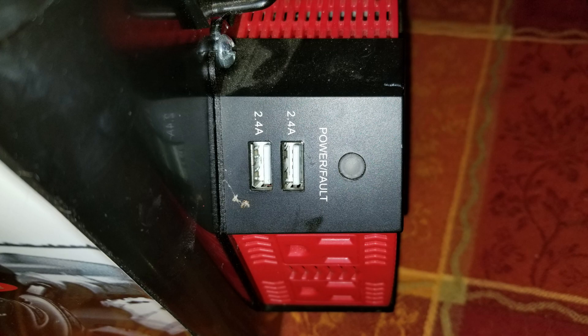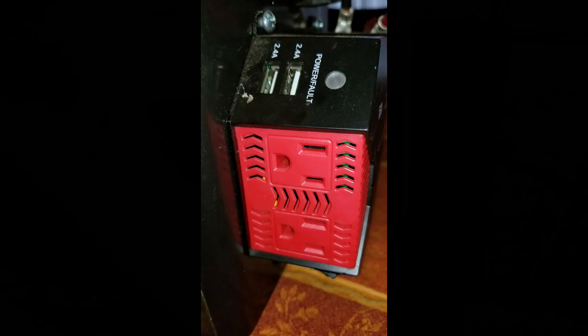It's not pure sine wave — it is a modified sine wave, which is okay for most of what I do. Looking recently, there are some smaller pure sine wave inverters available today that weren't really available in a compact form factor when I put this together originally. They were out there, just bigger and they cost more money. A pure sine wave that would fit this application would probably be at least two or three times the cost. I may upgrade to one before too long, maybe later this year, but I haven't really needed it. This gets me through most situations I'd find myself in — camping or maybe field deployments in amateur radio. It's worked well and is not really expensive.